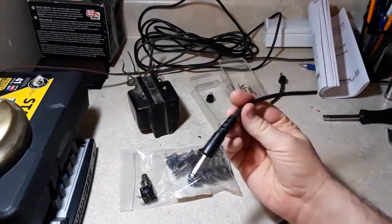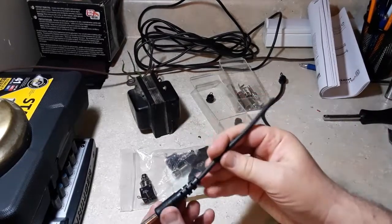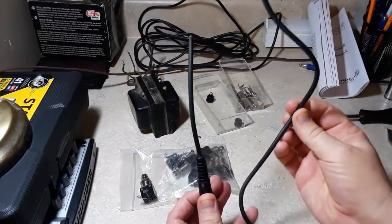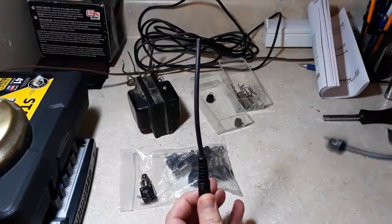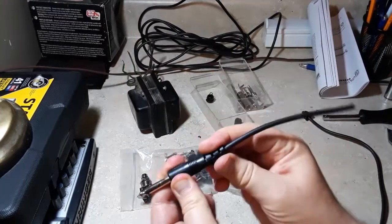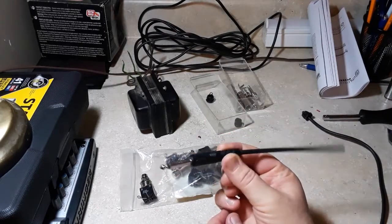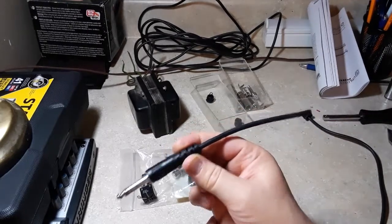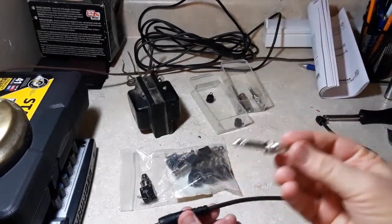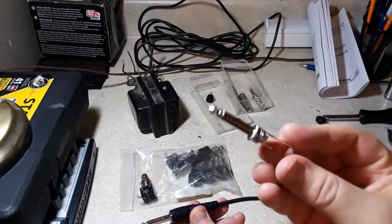Sometimes when you have a bad cable, it's likely within the first foot of each end. Here are the two ends of that cable. I did a little bit of analysis on that. This end, as I wiggled it, conducted just fine. But this end, as soon as you move that strain relief a little bit in the upward position as it was plugged into a little test fixture I had, it would lose continuity — so this was the culprit. I could have put a nice Switchcraft connector on that end by cutting off a foot, but then I might have that problem again. Now I can just use any guitar cable that will act as my footswitch cable.